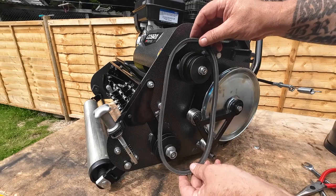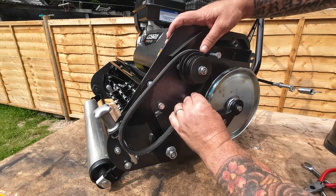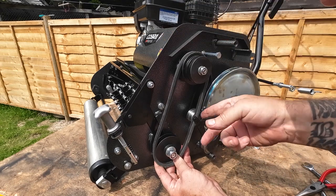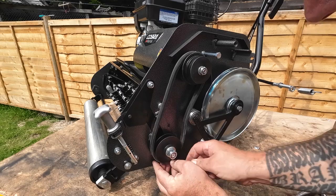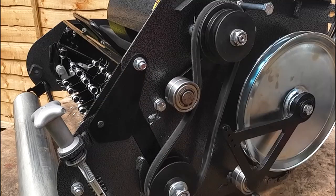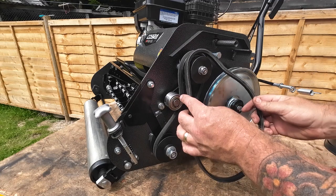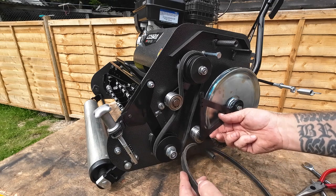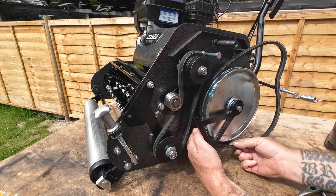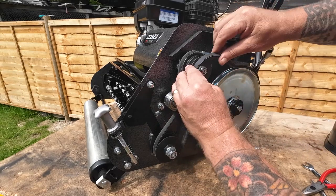To reinstate your belts it's just a reverse. On the top pulley at the back, feed the cylinder belt through — don't pinch it — onto the bottom pulley at the bottom. This belt comes over the top of the first pulley and over the top of the next one. When you operate your cylinder you can see it moving. For the drive belt, go down here first and try to get the belt in between the bottom pulley, then feed it onto the big pulley.